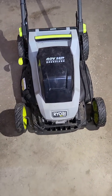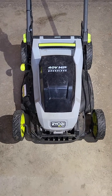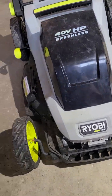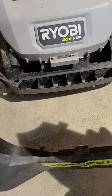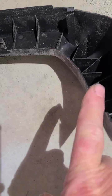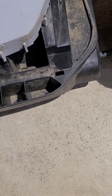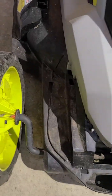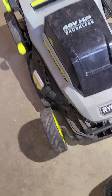First of all, in order to be able to get to all of the stuff that I showed you in the other video, you've got a few things that you're going to have to do — you learn from the school of hard knocks. This piece right here on the front of the mower, it's called a bump guard or whatever you want to call it, and it's got quite a few little clips that are push-ins. They all clip into the parts on the front. After you get that off, you can go up underneath the mower — but make sure you've got the battery disconnected and the key out of it before you do. You can get to all these from underneath and sort of pry and pop them out. The only one you couldn't get to is this one, and that one will come out fairly easy on its own.